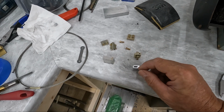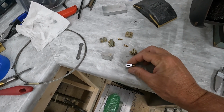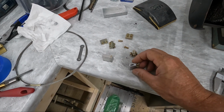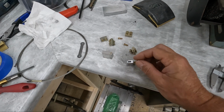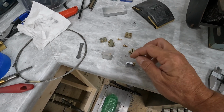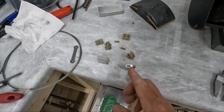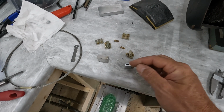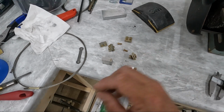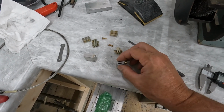What I ended up doing here is taking a drill bit and just drilling 3 holes right next to each other, as close to each other as I could, and then using another smaller drill bit in combination with the drill bit I used to drill this out, and just kind of cleaned out the hole. You really need to get those holes as close as you can to each other, so you have very little material in between. In most cases, I had a very thin film in between, or I had actually a gap that ended up showing up in between, so I could clean out the material a little bit easier. But I also just used a small metal file to do the final clean out on here. It turned out pretty good.